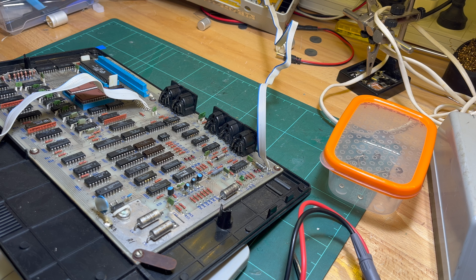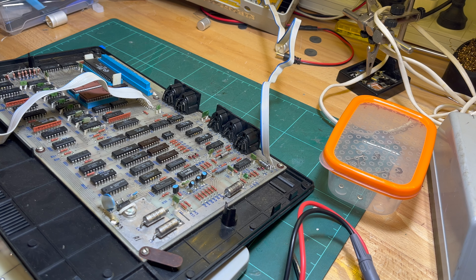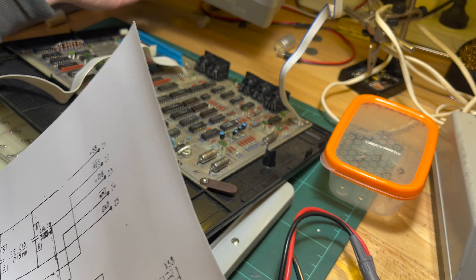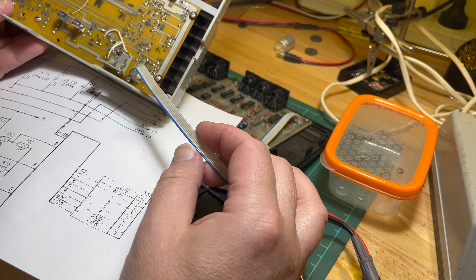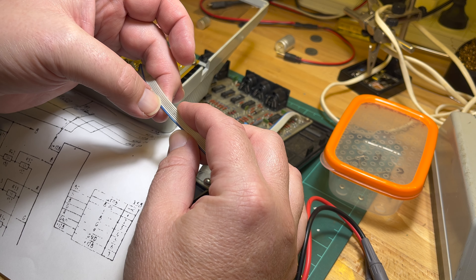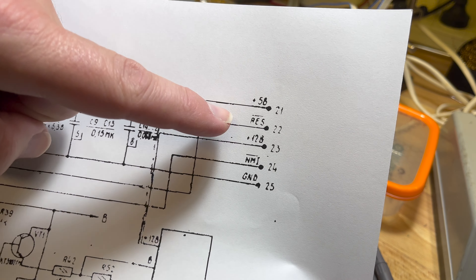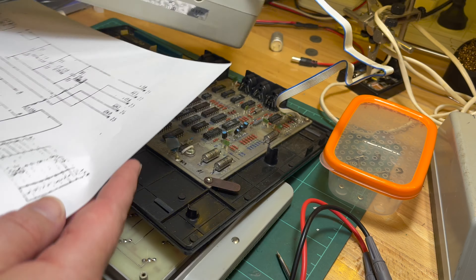What I wanted to do is try and see why this one wasn't working. I did test the continuity and I've got the schematics. We've got this little power supply here - let's count it properly: one, two, three, four, five, six, seven - okay, seven wires. We've got five lines: plus five volts, reset, plus 12 volts, NMI, and ground.